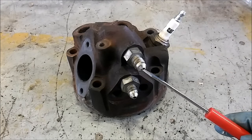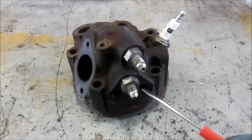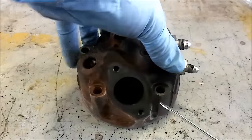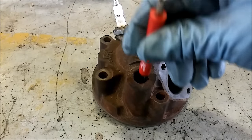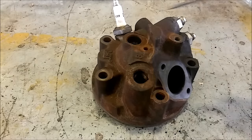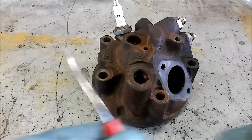I'm going to go over the components that connect to it. The first two fittings you're seeing are two fuel lines — there's a pilot and a main fuel line. Below that, there are two coolant lines that run to it. This is an antifreeze-cooled head. Here it is installed — you have your pilot, main, and coolant lines. If you remove the head, you'll have to drain your coolant or it'll dump all the coolant out of the engine. This port is called a secondary air port — fresh air fed to it to help ignition. And that port is for your ARD flame temp sensor. The tube on top is secondary air, and then you have your ARD flame temp sensor going into it. The top part is called a heated nozzle connector.